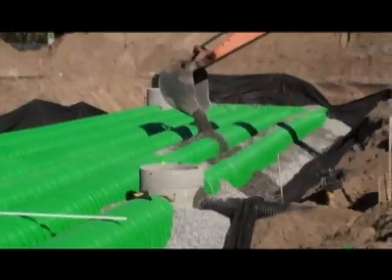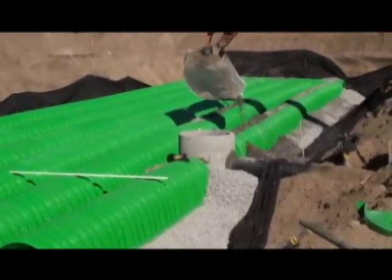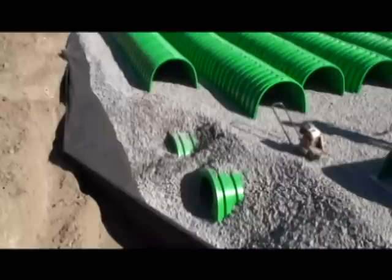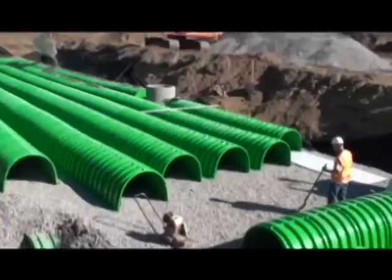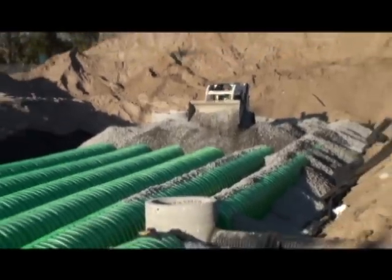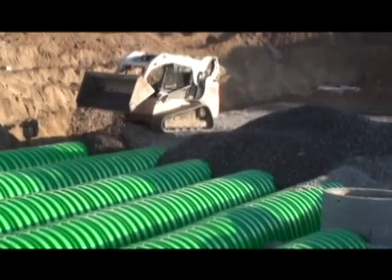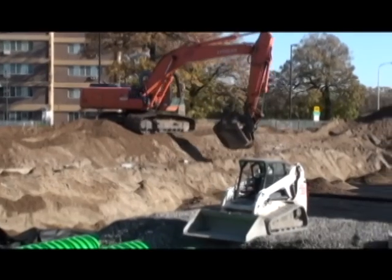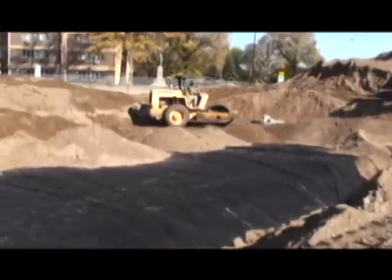After the chambers are placed, catch basins are aligned and connected and visual inspection is completed. The fill process of anchoring chambers with crushed, washed angular stone begins. It is critical to make sure that stone is placed at a careful pace to ensure that no gaps are left between chamber rows and proper separation of the chamber rows is maintained. Once the backfill covers the chambers to a sufficient depth, light machinery can be used to spread and level the material in accordance with the Triton installation manual. In this installation, 9.5 inches of fill will be placed over the top tier of chambers as preparation for the layer of pavement that will become the Civic Centre's parking lot. Please refer to the Triton installation manual to verify accepted fill materials and fill depth requirements for approved users.